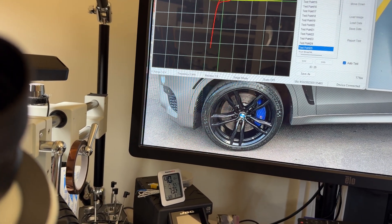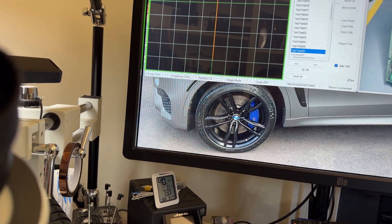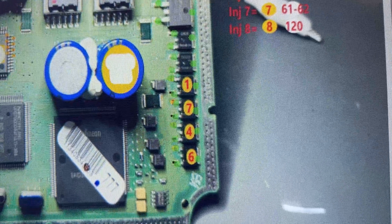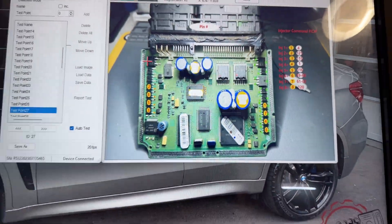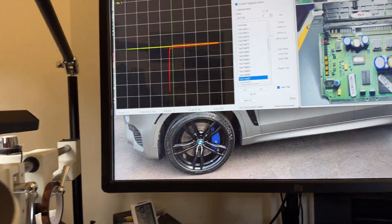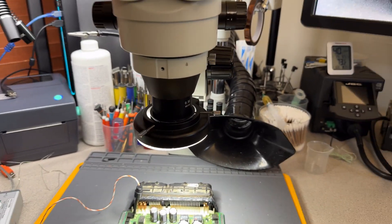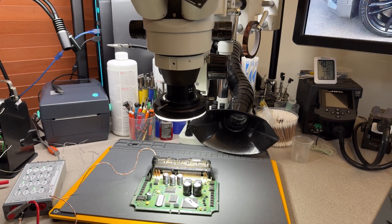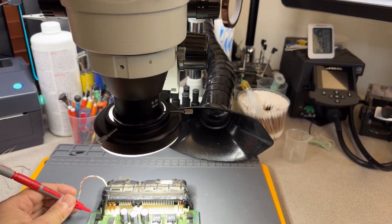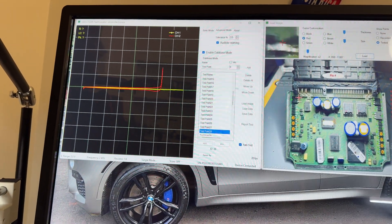Injector six - perfect, excellent. Looking at the board now, all that section is green. I replaced all the drivers and pre-drivers - everything - so this is a complete repair. Remember this was not passing before and now it's all green.